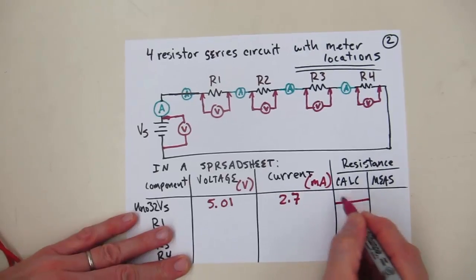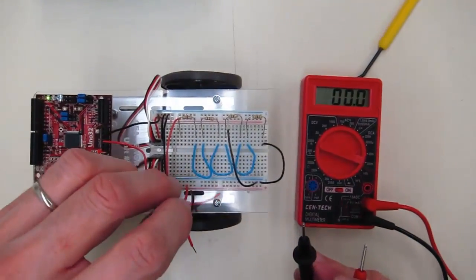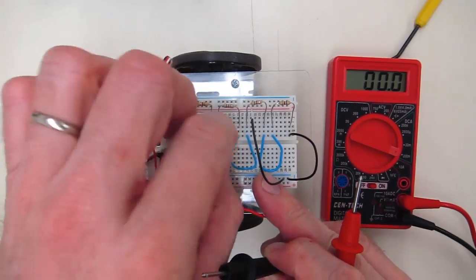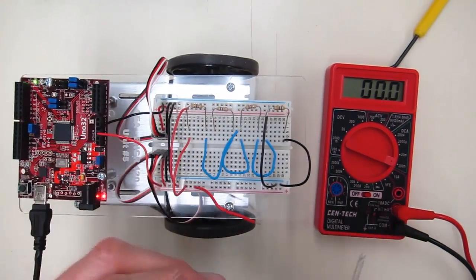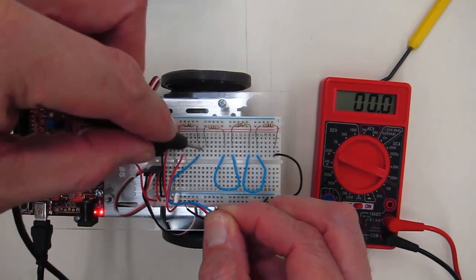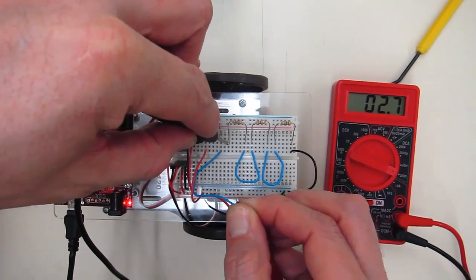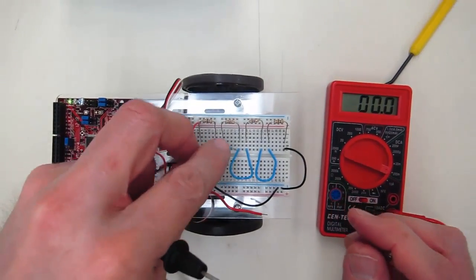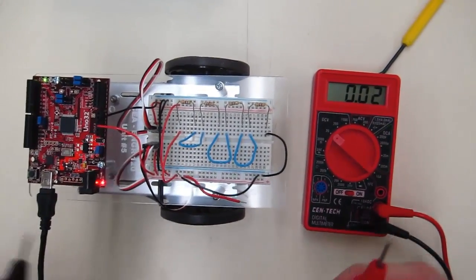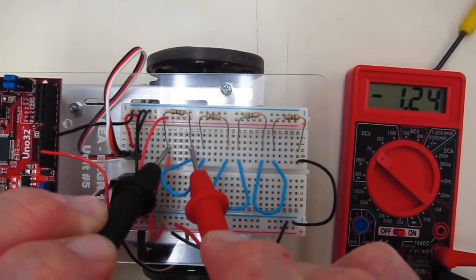You're going to have to calculate what the effective resistance would be on your spreadsheet. Let's make another current measurement while we're at it. I'm going to complete the circuit again. While our meter is still in current mode, I'm going to pull loose one of the blue jumpers, then connect from that blue jumper to those resistors. The current passing through this is also 2.7. So you need to record that bit of data. Now I'm going to jumper that back together, and for this first resistor we need to measure the voltage. I'm going to switch back to 20 volts and measure the voltage across that resistor. The voltage across it is 1.24 volts.